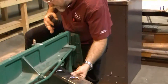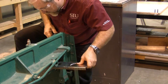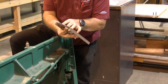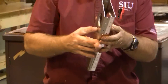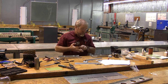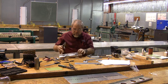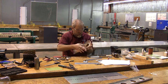We're going to do that again for the other one. Hold it in position. Make sure that each flange is all the way against the table. Tear that off, and we have our very nice cut. Now, just like everything else, I can't forget that I need to deburr and round my corners. But once that's done, I'm going to be ready to reassemble this spar with the damaged section cut out.